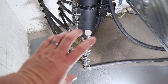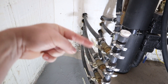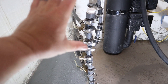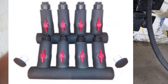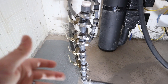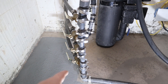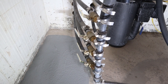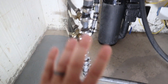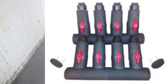You can also use pre-manufactured manifold systems that are generally made out of PVC and insulated. I should have all of these insulated because these lines can sweat, so I would suggest insulating your lines. The manifold itself is made out of PVC, it's got the shutoffs all within it, and it is insulated to start with. There's a link in the description from Amazon — they're actually reasonably priced — or you can just make your own out of PVC. Remember, all you're putting in this is water and some sort of antifreeze, so it's not a real corrosive fluid. If you don't want to make your own, just buy it — it's not that terribly expensive and it'll probably save you some time.